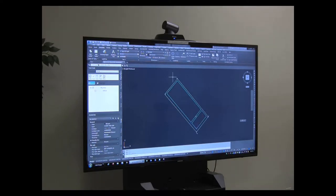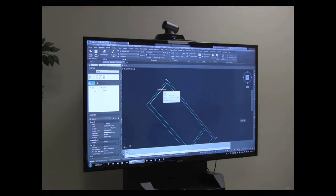We tied these four monuments that define our two blocks with RTN GPS. Does anybody want to guess how they fit record? Not great — we're pushing around three tenths to half a foot. Now here's the problem that creates: these four monuments missed the record by about three tenths. And yes, there are three or four story buildings around there — it's just not a great GPS environment. Here's the conflict this causes: if you read Brown's, you know the common law says if there's a conflict between the record and the monuments, you're supposed to hold the monuments.